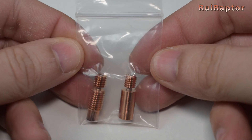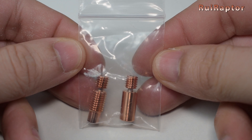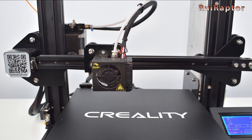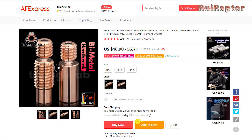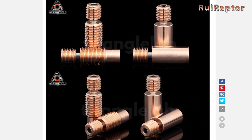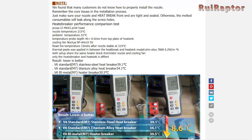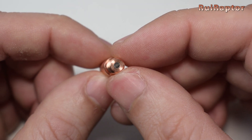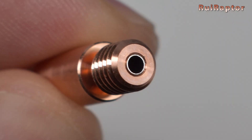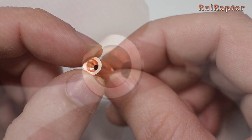Today we will talk about bimetal heat breaks and how to install them on a Creality Ender 3 or Ender 3 Pro. Bimetal heat breaks can be found online by many manufacturers — the ones we ordered came from Triangle Lab. These heat breaks have two components with different thermal conductivity. This dual metal combination means that the temperature from the heat block is not transferred to the cold end of the heat break. In other words, you will be able to use higher temperatures and have less heat going up the heat break cold zone.